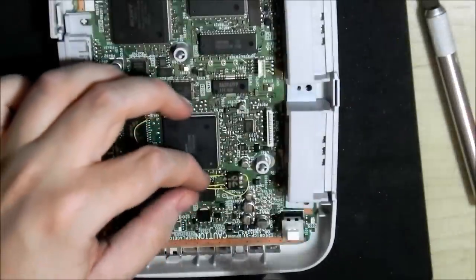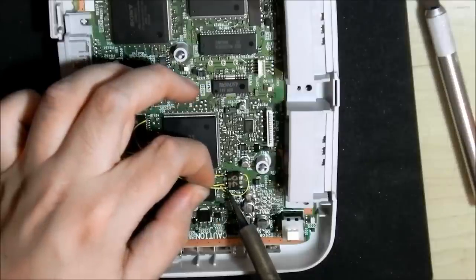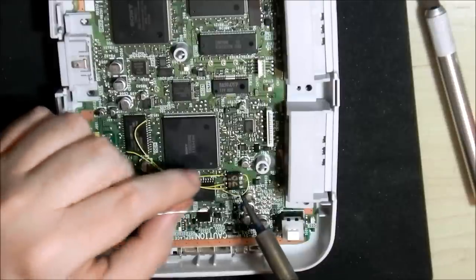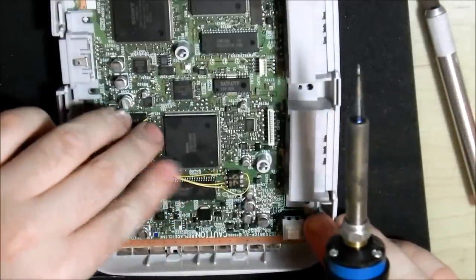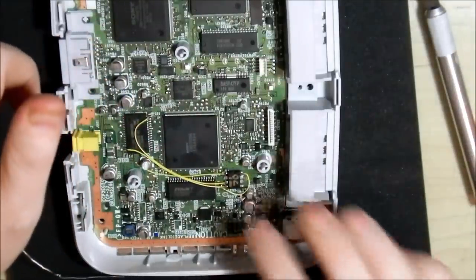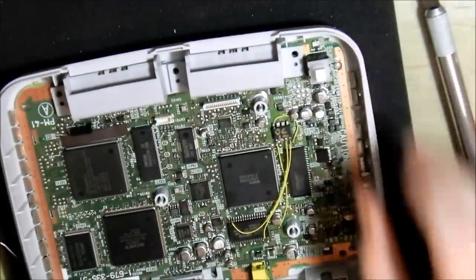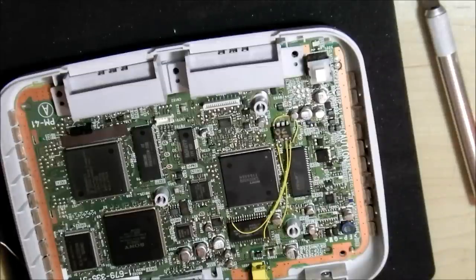That wire doesn't look that great — I'm just going to go from this direction. Once you start adding old solder you get dull solder points, and not only does it look bad, but you know that point will give way and break within a couple of weeks. Maybe you're lucky and it's the power point that lifts up and connects to ground somewhere and blows your whole system — mind you, the chances of that happening are slim to none, but it's pretty good to be aware and just be careful.